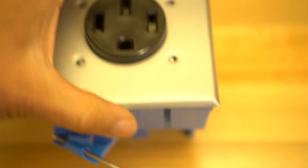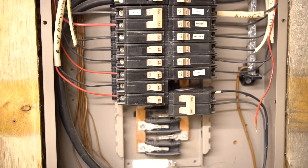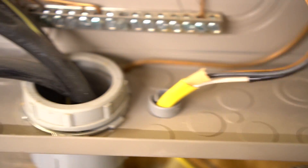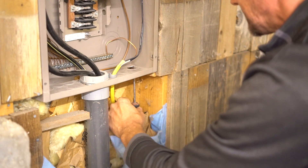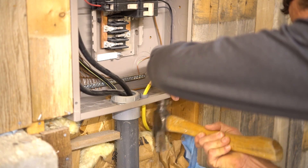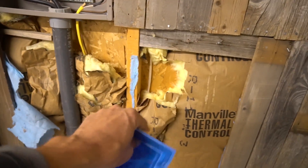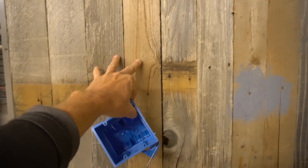Once you have the box on the wall, I have an attractive silver cover that goes over the top — it'll look really nice. You screw everything together and plug the charger in on the wall next to it. On the electric box I need to choose where to put the knockout. There are perforations in the metal on the bottom, so I'll use one of those. For maximum niceness, I decided to position this electrical box a bit to the right, because the JuiceBox Pro has a very short cord — I want the plug here and the JuiceBox hanging up nicely beside it.